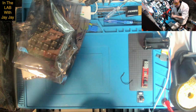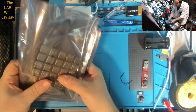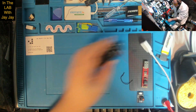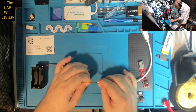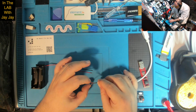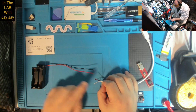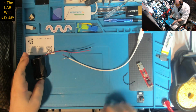So I thought I'd use one of these. I've got 3 of them, so still got some spare. And that's what we'll be doing. We'll be connecting this and this, and there's no need for the data lines. We'll just tie them off. So it'll just be a little bit of soldering, a little bit of heat shrink. We'll snip off these data lines, and then we'll be good.